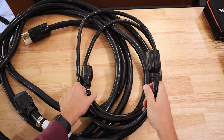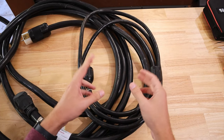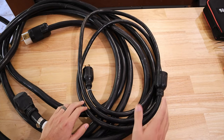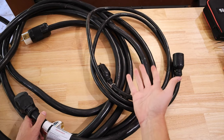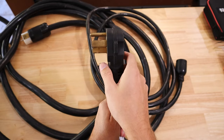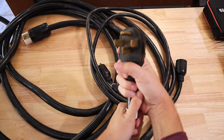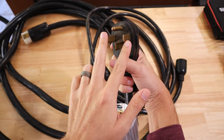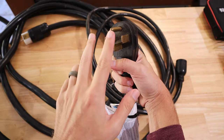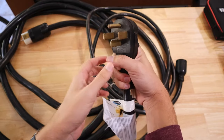But those folks doing it old school — that I mentioned in my comments — will go to their home improvement store and pick up a dryer cord. A 220-volt dryer cord is going to look a lot like this: you've got all your prongs for your 220, your two hots, your neutral, and your ground. Then you just plug it into the dryer port where you would normally plug your dryer in.